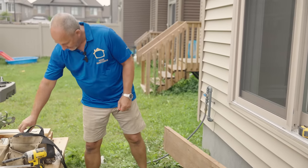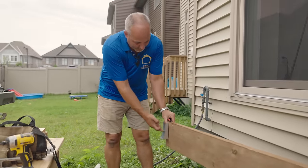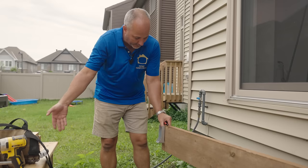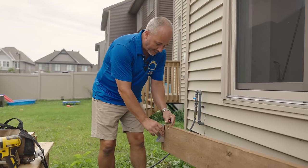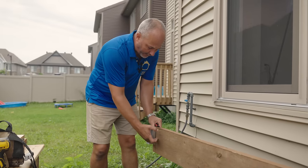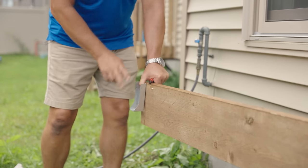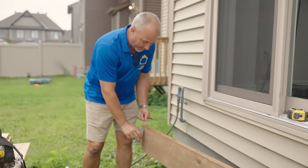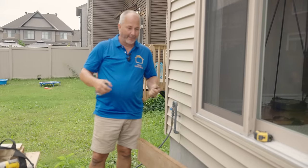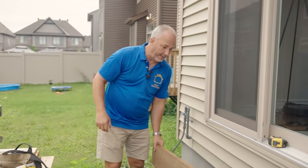okay? And then you're gonna wanna use something like this that has structural screws in it to bring out one joist and then tack a second joist on the outside into this, right? And then you have the second one here so that two of them add extra strength, but then you're nailing everything together at two different lengths as well. Two different ways, two different fasteners, some screws, some nails. It just really multiplies the capacity of that, so you can't just rip it apart with your bare hands like the last one we had. But I'll get into all of that in a minute.